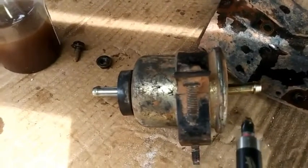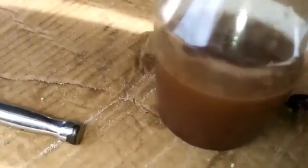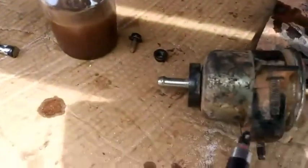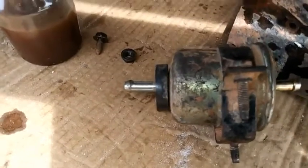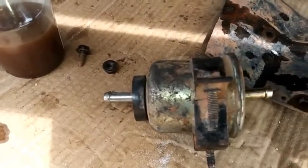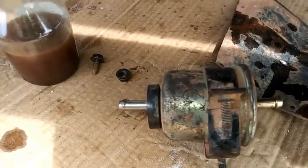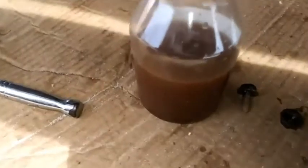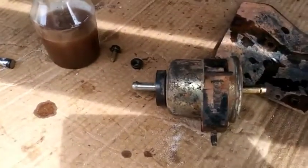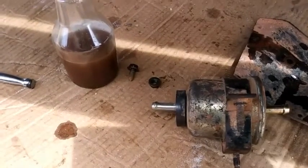That's the level of contamination in the fuel, and this will require more frequent servicing of the fuel filter by back-washing it or replacing it. The next solution to this problem is to try to replace the fuel tank, maybe with a plastic one or a new one.